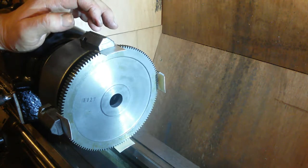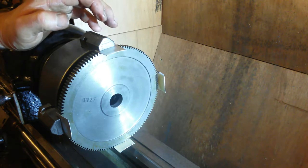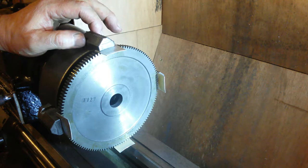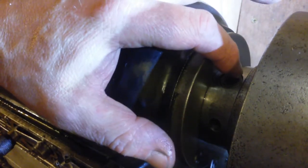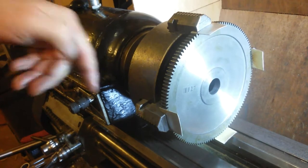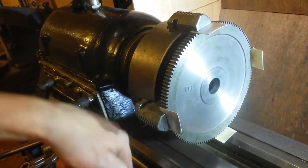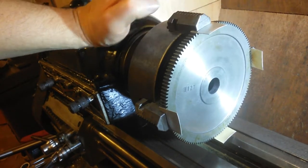I might just get a ratchet strap and blocks of wood. Sounds a bit rough, but I think a few blocks of wood with some ratchet straps will probably do it. Or I might get a hole saw into a block of wood. So I might get a hole saw and make it approximately this size, maybe one size down, cut it in half, get it so I can put a wooden clamp around the spindle nose here, and then have the wood coming out to about here, and then have it all the way down the front or all the way down the back, it'd be even better, it's nice and flat down there. Clamp a piece of wood on that and then screw it together just to try and lock the spindle up. But I'm going to do something to lock the spindle up.